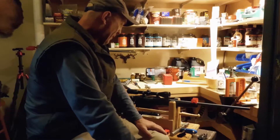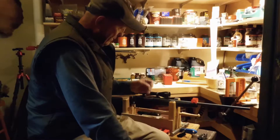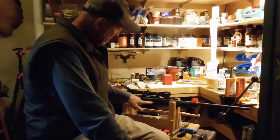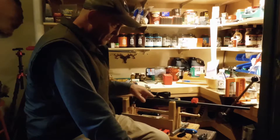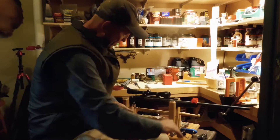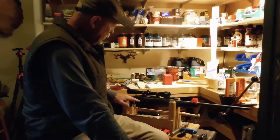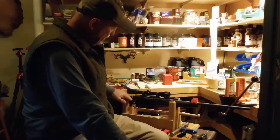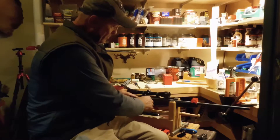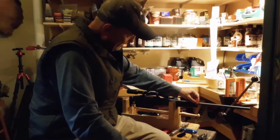I talked to the gunsmith at the shop that actually glass bedded this for me, and he advised me to take it back out. Look in the two recess lugs where the bedding blocks go, and make certain there isn't some tiny amount of debris — particularly at the rear one — that's canting the barrel to produce this contact. He said make certain that the rear bedding lug is anchored and sucked down tight first, because if you suck the other one down too much too soon, that's when you'll bring the barrel down and cause this. Right there, that's definitely tight.